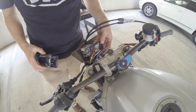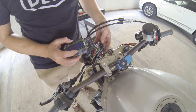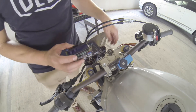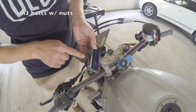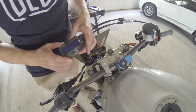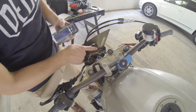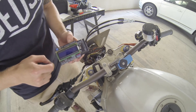Here's the old Arduino Mega setup and here's the new one with the screen — same one that someone ripped off. It's mounted to the bracket through a couple of holes, and then a longer bolt goes through everything with a nut on the back to hold it all in place. I found I had to do that because as I rode, it would vibrate and pop off, especially trying to squish down with all these wires under it. That just helps keep your screen from going blank while driving.